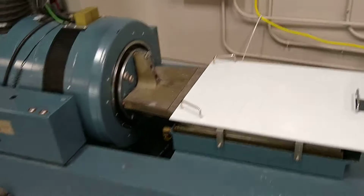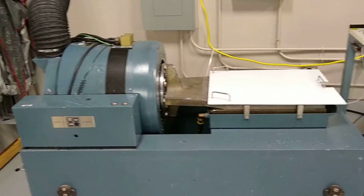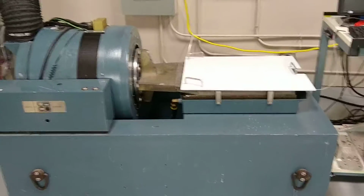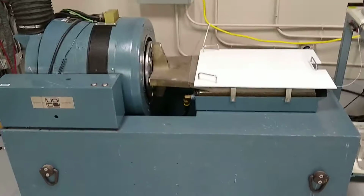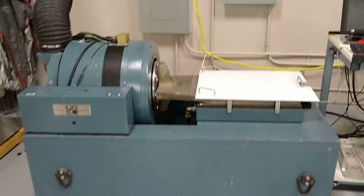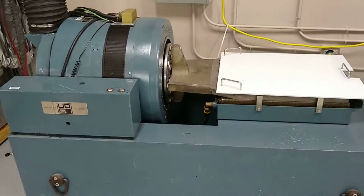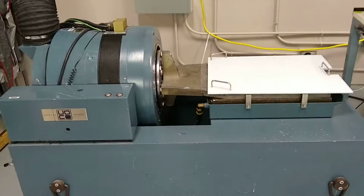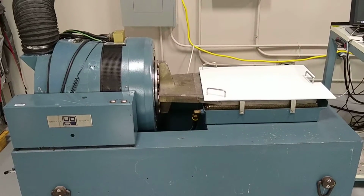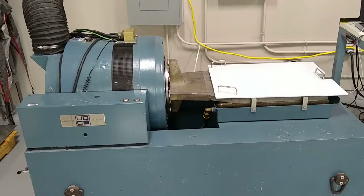Now we can fix the satellite on this vibration table and then see if every component is fastened enough that it doesn't fall apart. Now we had these cases that sometimes there is a screw loose, and then you shred, really, literally speaking, your satellite apart if that happens. Before you launch a satellite, you want to test this out on the ground because, well, you don't want to lose millions of dollars for a satellite that you launch into space, and you want to find out if there is some kind of design flaw with your satellite that you can fix still while it is on Earth. And that's why we use that vibration table.